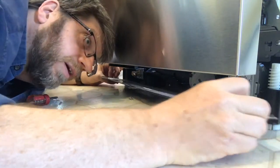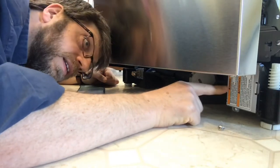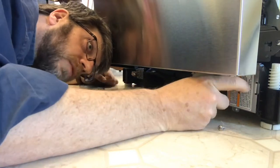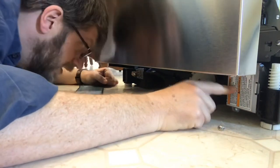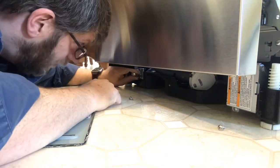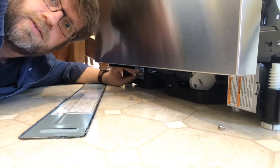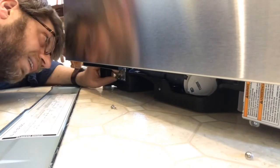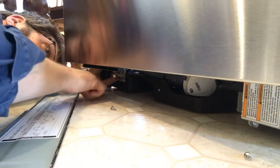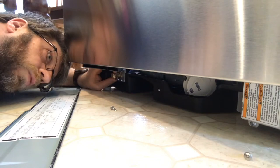Here's what I have. I have an electrical box right here - this is where my electrical cord will be attached to. It'll probably come in the back. I'll take this off - there's one little screw holding this front plate on. And then I have my supply line right here. My supply line is here and it screws on. It's small and it's kind of tucked back there, but the supply line will run underneath the dishwasher right here and kind of go straight to the back.